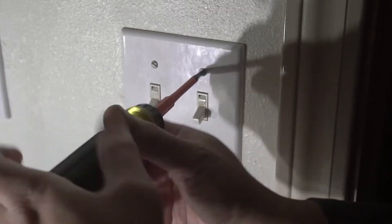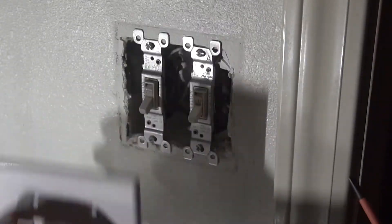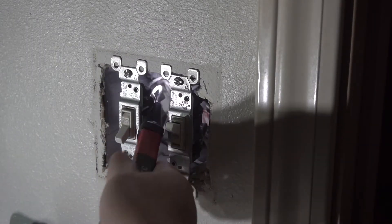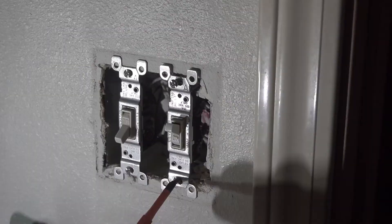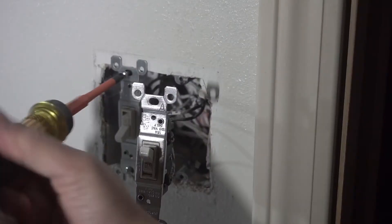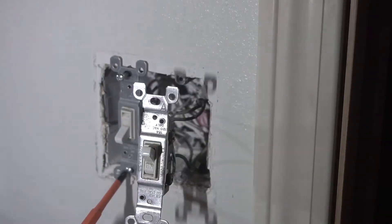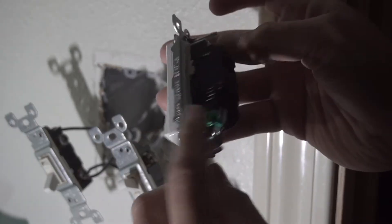I'm going to be using my flashlight as secondary lighting, so the video quality on this part will be very poor — it looks like I'm filming on the moon. Take off the cover plate and double-check everything with your voltage detector. There is a switch on the left side that is still beeping, which is why it's very important to double-check with your voltage detector even after turning off the circuit breaker — there may be other live receptacles nearby. Test your voltage detector on a known live wire first to make sure it's not faulty. The left switch controls the ventilation fan, but I'm also switching that out to match the new Leviton switch.